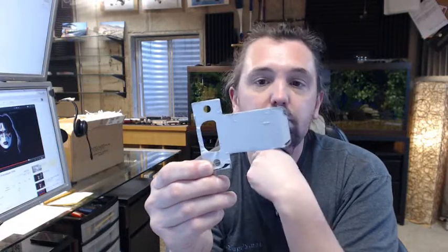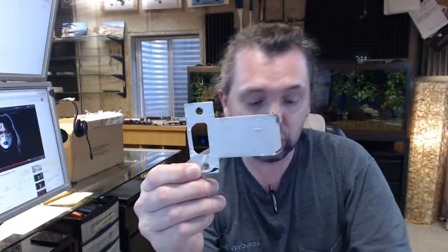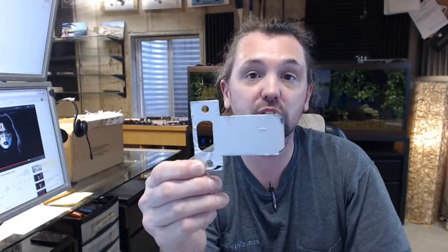Typically the construction of that sort of thing uses very thick material, and applying a T-Strike with an extended lip makes sense if you have a pantry door with a roller latch and a jamb where the rest of the cabinetry is connected. And if you are thinking of extended lip strikes, you might need to consider wide throw hinges as well.